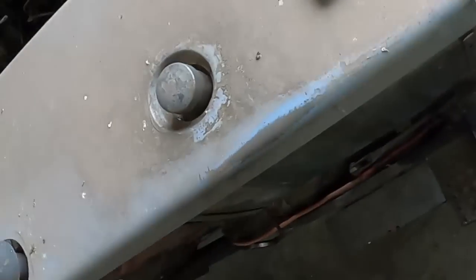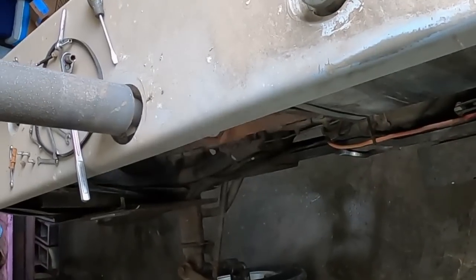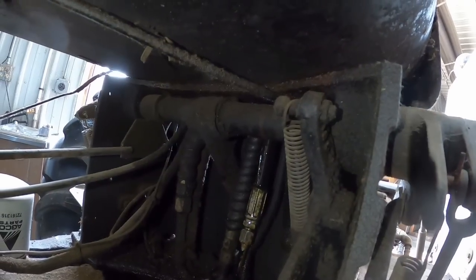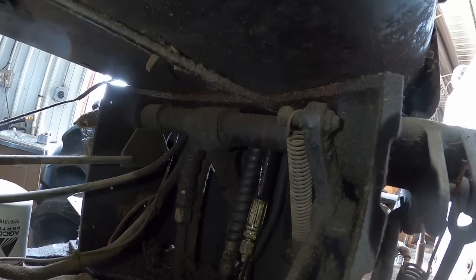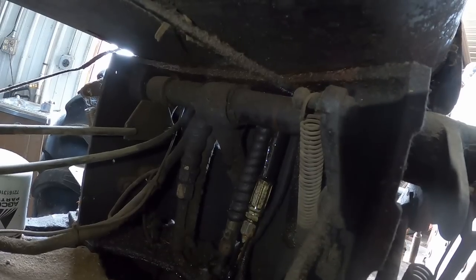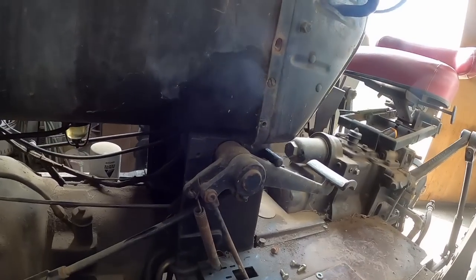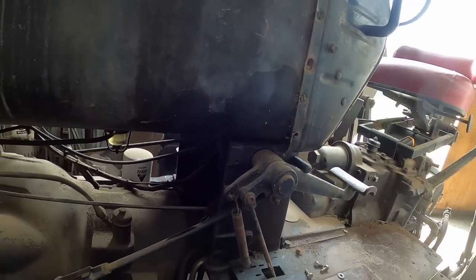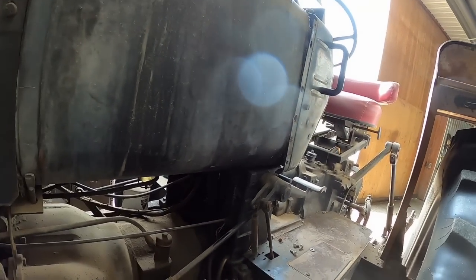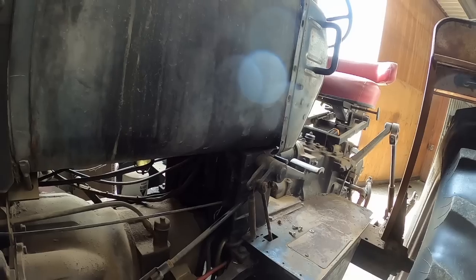Now I'm going to fire up for just a moment. I'm going to double check, make sure I don't have anything by the crankshaft that's going to go crazy. Well, this very leftmost line is getting quite wet, so it's definitely following that down. It doesn't mean it's the leaker. That one looks homemade, though, so it's probably the leaker. So maybe I will see what all is in there before I order a line. Maybe there's some kind of homemade thing I can fix. But that means draining the gas tank. Yay. Because it's fairly full, because I was ready to mow hay.